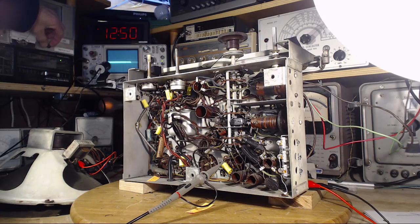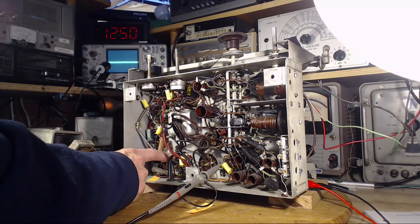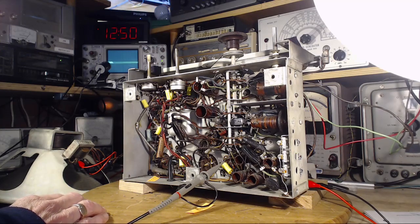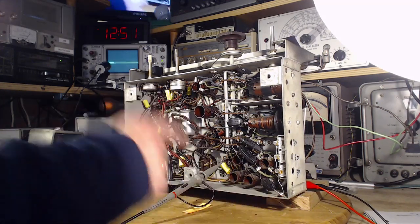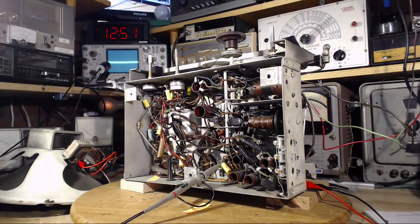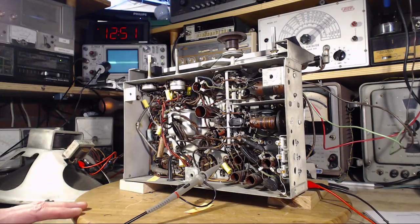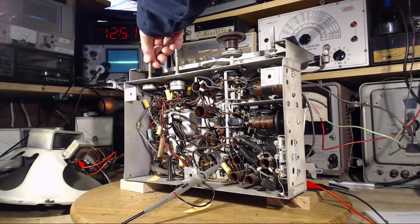So we could be seeing the effect of the other capacitor. There's supposed to be, was it a 10 microfarad capacitor there? Wait a minute. I replaced that over here. That's taken care of. Well, that's what we got. It's a little bit better than it was. We don't have a leaky capacitor in there anymore, so that might actually be a more significant improvement than we're realizing when we look at the scope. One more to go.